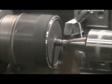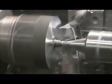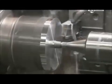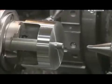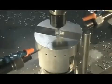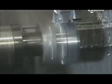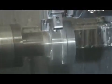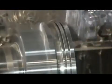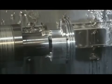They insert each slug in a lathe to give the forging the correct shape for machines that handle it later. Small holes allow oil to flow through to lubricate the piston when it's in use. Another lathe reduces the diameter by three millimetres, and the same machine then cuts three grooves — two for compression rings and another for an oil control ring. These rings help the piston glide and provide an airtight seal.